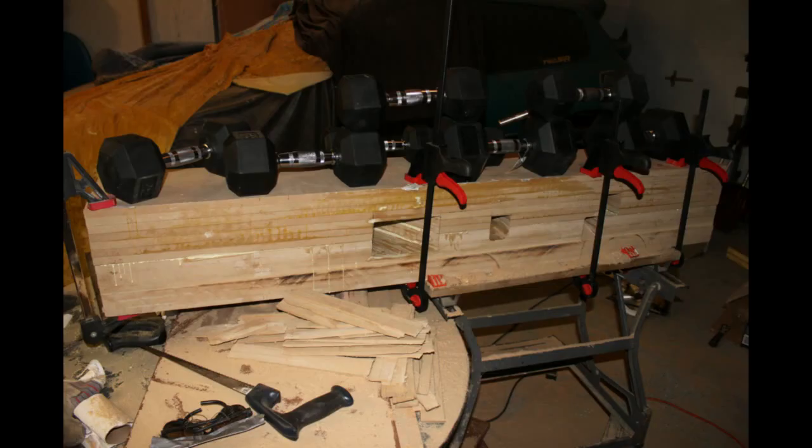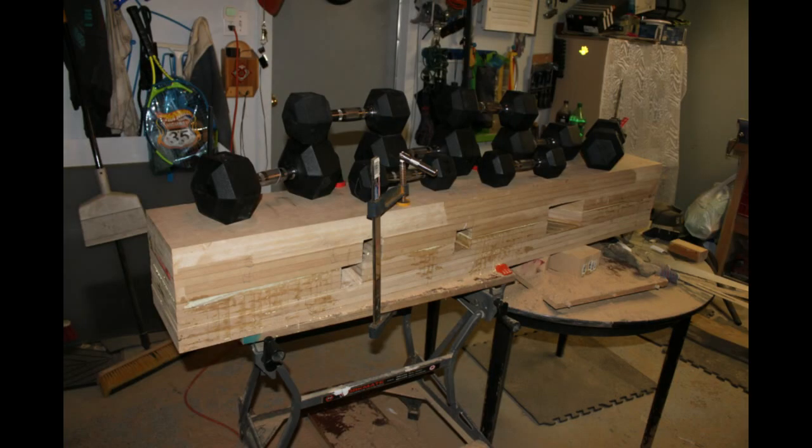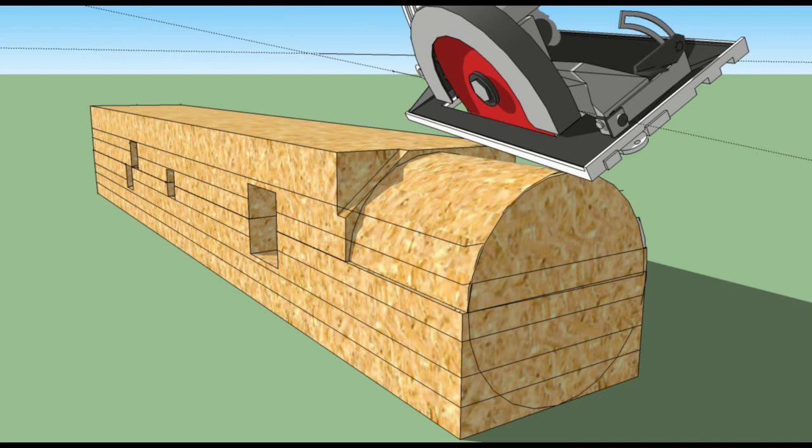Once everything is good, I clamped it down with glue. I only had 7 clamps and that's really still not enough, but it will have to do. Now cutting it — I used a circular saw, I didn't take any pictures because it was a real mess; saw dust goes everywhere in the garage. Cut it at a 45-degree angle on all four corners. Because your saw has only a 10-inch blade, it's only going to cut both sides on each angle. You're going to have to cut both sides — one on each side — just to get one corner. Most of the time I couldn't even get the corner to cut off. I have to finish it off with a hand saw to get one corner off because it's such a thick piece of wood. So there's a lot of elbow grease involved — it has to be cut twice with a circular saw and once with a hand saw to get the whole corner off.